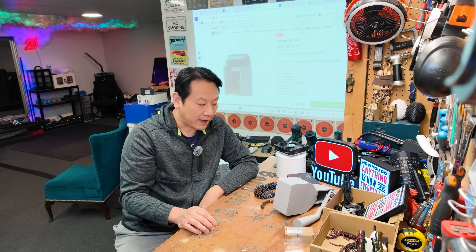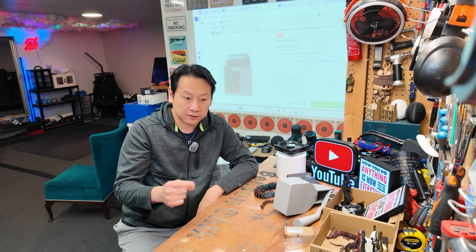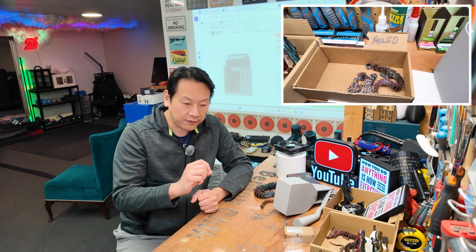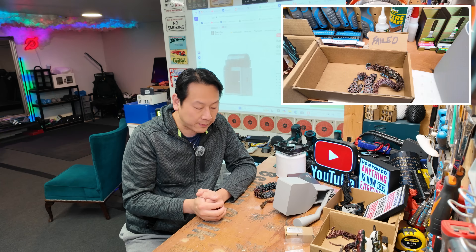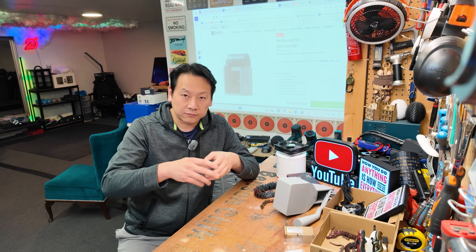The other thing is the nozzle. I had the machine for about seven days of non-stop printing. The nozzle that comes with the machine is a 0.4mm nozzle. After about a day or two of printing it started giving me problems — the extruder started making a very soft clicking noise, like the filament doesn't want to pass through. The machine threw up an error code saying 'abnormal filament resistance.' I opened up the assembly, cleaned it, and tried different filaments.